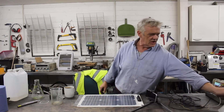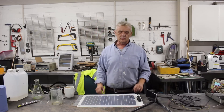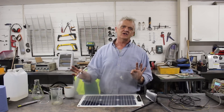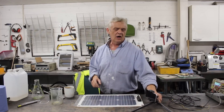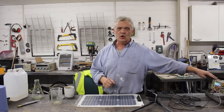We've got a little setup here: a voltmeter reading voltage, and a solar cell from Radio Shack that I bought about a million years ago — not brilliant but it still works. We're going to put a bit of our chlorophyll on there, but we can't just put the chlorophyll on because it's in alcohol, so it's going to evaporate quickly. I've got a sheet of plastic to stop that evaporation. When light hits the plastic it hits two surfaces, so I'll put some IPA on there to reduce that to one surface, giving us a fair test. I've also got a camera set up on the voltmeter so you can see the effect.